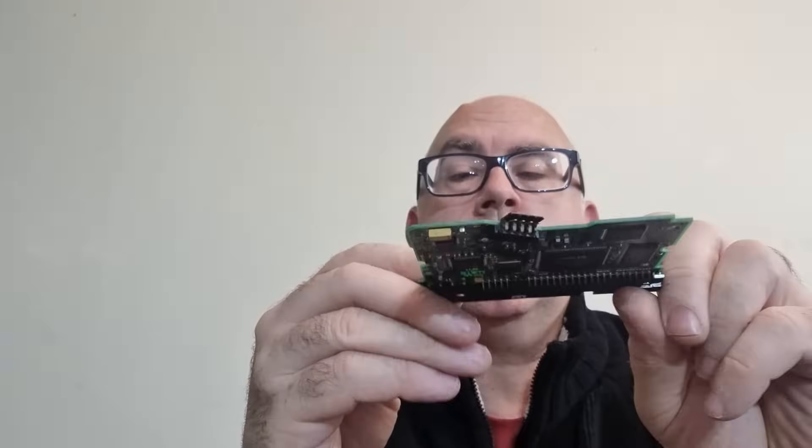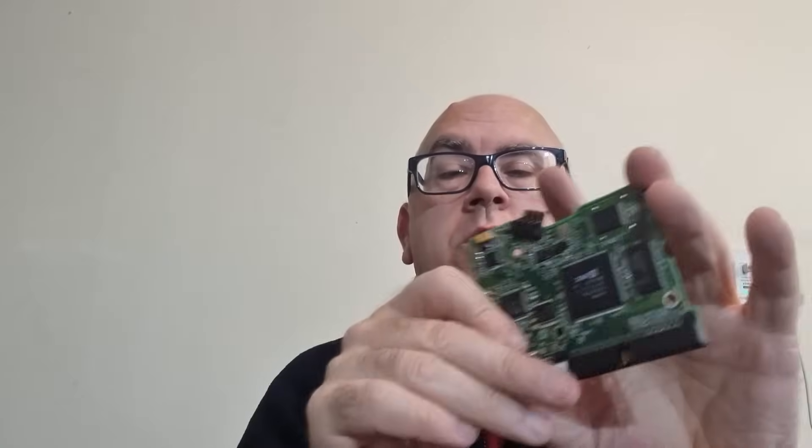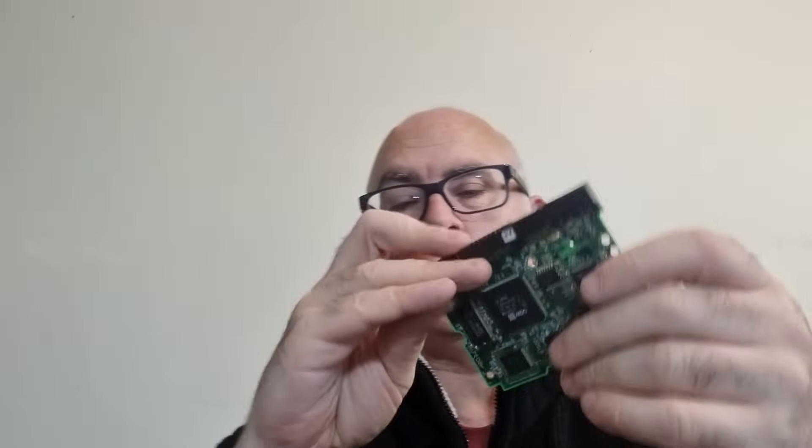That's the first video in the series of where is the gold. That's where I find gold in hard drives. Have I missed anything? Are you finding gold or precious metals somewhere else I haven't pointed out? You might sometimes get silver flashing on the boards, but it's not something I'll go after because cleaning the boards well enough to avoid tin solder contamination is a lot of work — and as we all know, tin will play hell with your gold recovery.